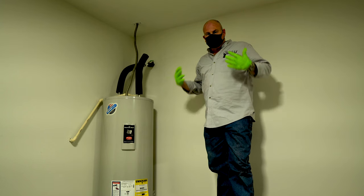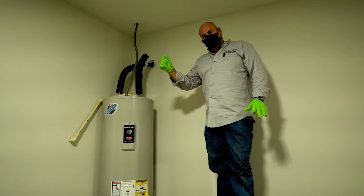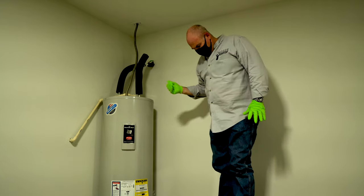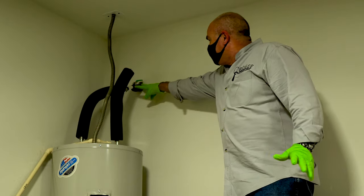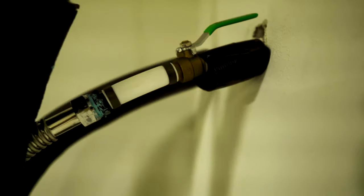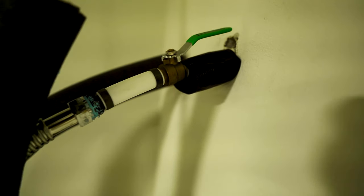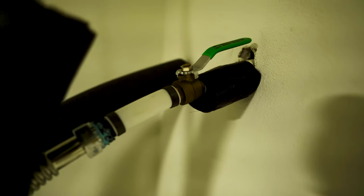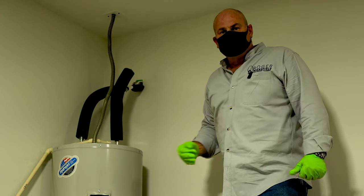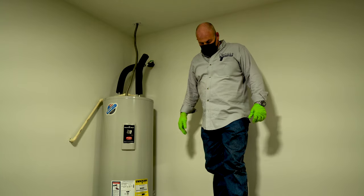Here's one of the biggest problems that I run into. I've got several things open, but when I go to the kitchen on hot, the pressure slows way down. I go to cold, it comes back up. We have a PEX ball valve. Nothing wrong with it — you've got a crimp back here and a crimp back here, and it reduces the size. The ball valve itself can't be as big as the inside of the pipe because it's got to go inside and be crimped. This is creating a flow restriction, and this is leading to a problem for these customers.